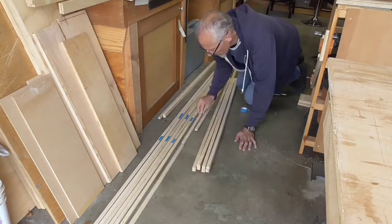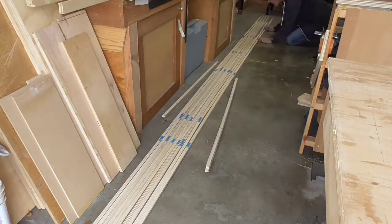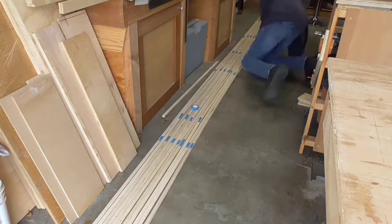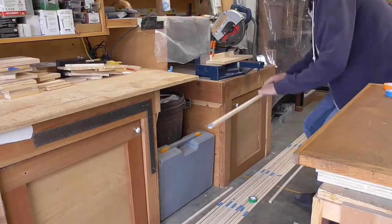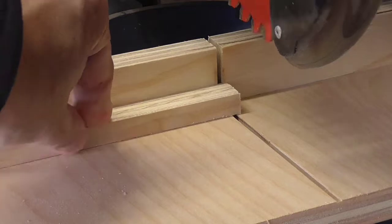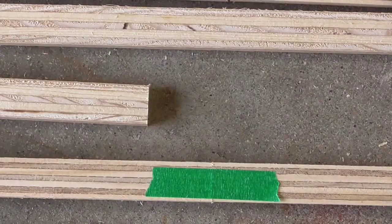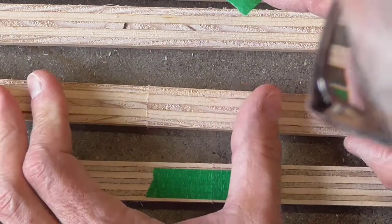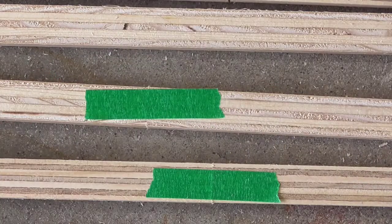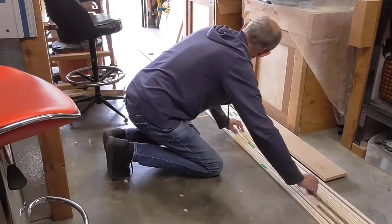In order to do that with the different types of plywood and different grain patterns, I had to be really careful to keep all the orientation the same when I cut these things. Then I had to splice them together — that's where all the little blue tapes are, they're splices. I went back and cleaned up all those splice joints so that eventually these things would match up and hopefully give the illusion that it's just one solid piece going all along the back.